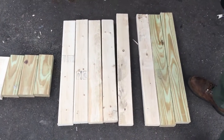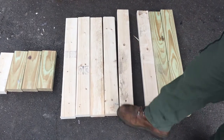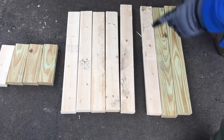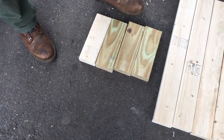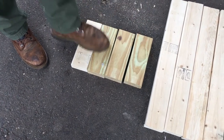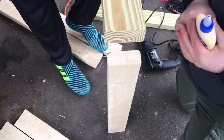You need to take off three inches total — so you have an inch and a half at the top and an inch and a half at the bottom. Those four pieces of 27 inches account for that. Over here we have our four pieces of 10 inches for the structural support, just to hold it all together. You really only need two pieces of pressure-treated and two pieces of regular, but we ran out of regular, so we just had an extra piece of pressure-treated.